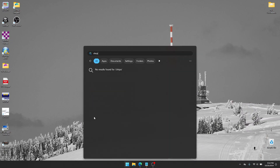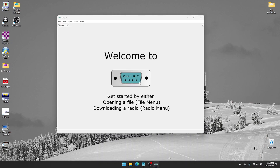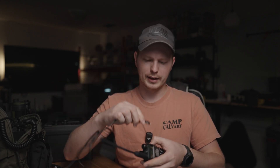At this point we can open up the program and we'll be greeted with the welcome interface. We are then going to plug our cable into our computer and connect it into the radio. What we want to do is unlock your radio. The reason why we want to unlock your radio is that, although technically it is illegal, in the event of an emergency we want you to have every advantage you possibly can to make contact with somebody.